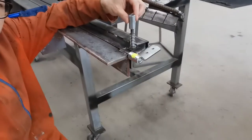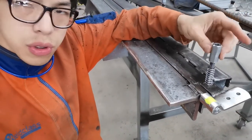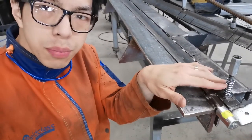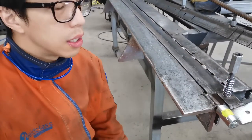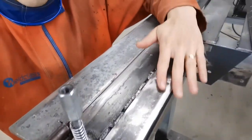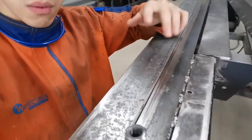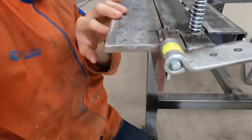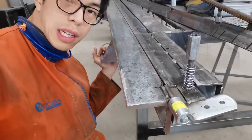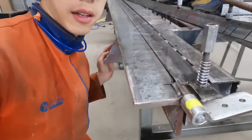Firstly, I've used a more convenient coupler, but I've used it as a nut to tension the whole die. A spring with a higher spring rate, so it doesn't sag, theoretically. I've also added these swivels, so the die can sit properly both ways. It's a 10mm movable component, really sturdy, but it actually still flexes with a 1.5mm sheet.